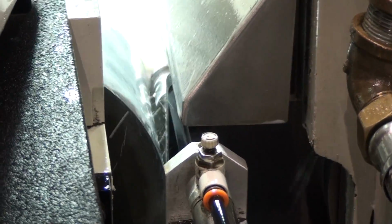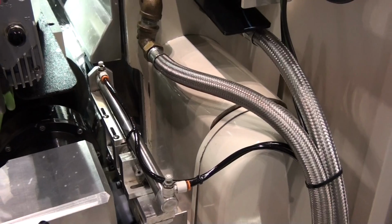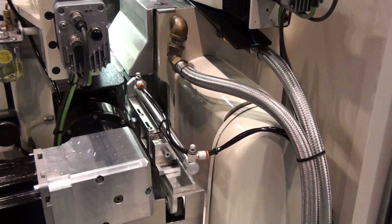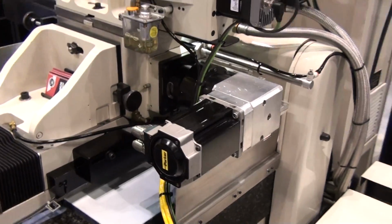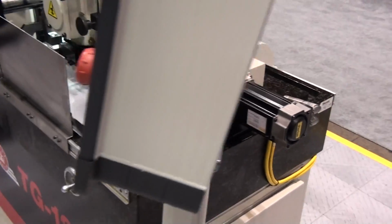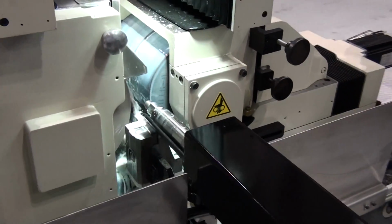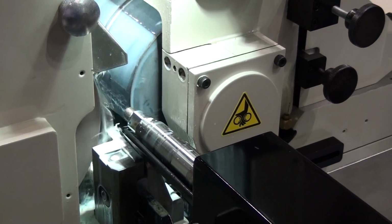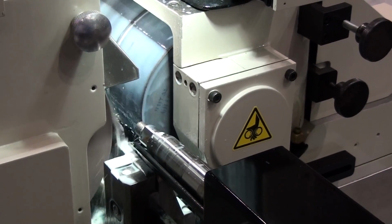The grinding wheel spindle design has 3 sets of Class 7 ABEC angular contact Simpson bearings inside a large headstock with an outboard self-centering bearing set for a twin grip design. This design gives the grinding wheel spindle superior accuracy. The regulating wheel with its 2 1/4 inch, 57 millimeter diameter spindle and Timken bearings allows for the most demanding applications to be ground with 0 deflection. The 8-inch, 203 millimeter diameter regulating wheel allows for closer tolerance with larger diameter work.